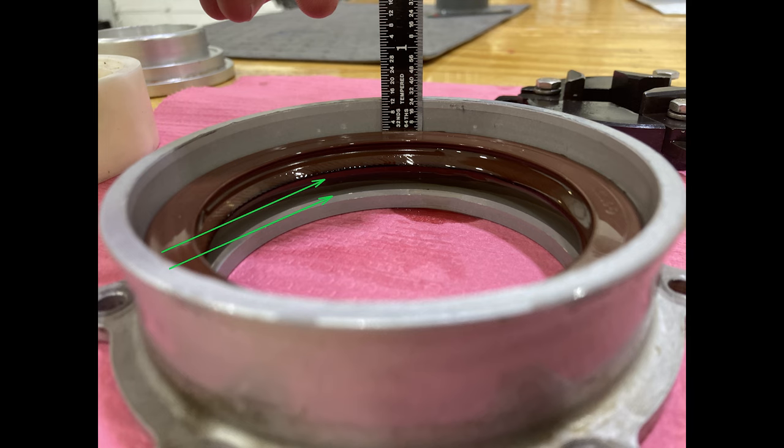One other thing about the seal is it doesn't go all the way down into this cover or this seal housing, all right? There's a space. The reason there's a space there is to get the removal tool into there. If you pushed it all the way down, then you would never be able to get it out, and it would probably be in the wrong position on the drive and wouldn't seal. But anyway, that's just a heads up. There's a gap. It's just the way it is.